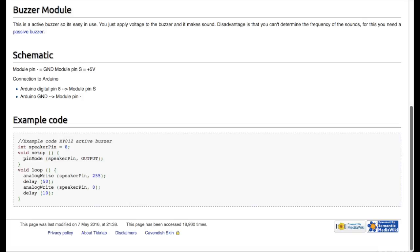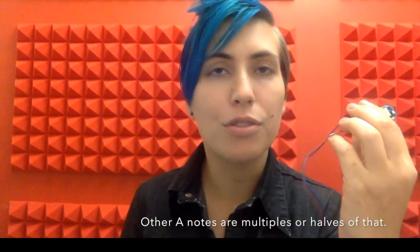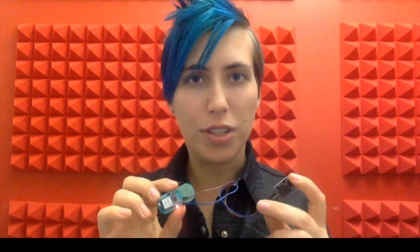As you'll see, this is enough to create a kind of clicking sound, but not enough to make something very interesting yet. Let's increase the frequency and see what happens. An A is about 440 Hz, meaning we'd want to turn the buzzer on and off 440 times a second. As we increase the frequency, we'll get a higher and higher musical tone. That's a delay of just two milliseconds — that was about 250 Hz — and here we are at 500 with one millisecond either way.